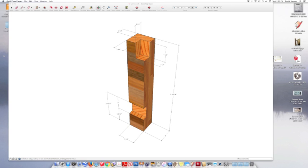Out of the top I have a notch cut — two and a half by two and a half square, and it is four and a half inches tall, which is slightly below the height of the joist that's going to fit in there, so the bench top will sit on top of that. Those are the dimensions of the leg I'm working on right now.